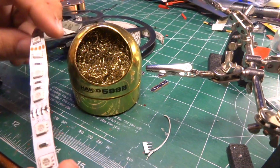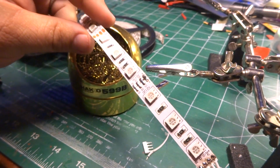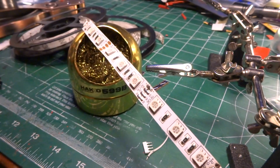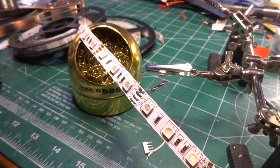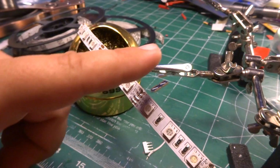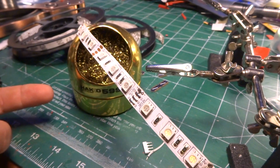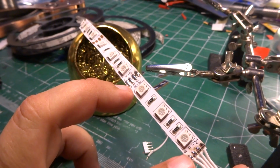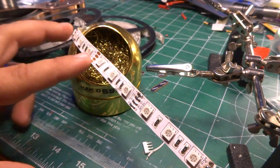And, well, when you look along the strip, you'll notice that these have natural breaks in them. Here is an area where 4 leads are connected together. They're actually continuations of the same wires with an exposed end to it. The exposed end can be used as pads to tap off of. The idea is the pads themselves are wide enough that you can actually cut them in half right there, and you've got a left and right side that you can solder to. So that you could make an individual unit of these 3 LEDs, could be an individual array of LEDs, and then you wire up this guy in a separate spot, and this guy in a separate spot.